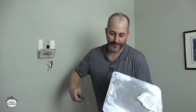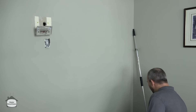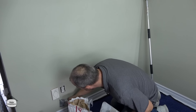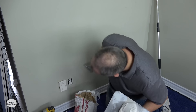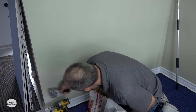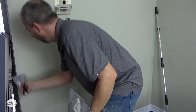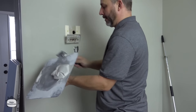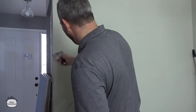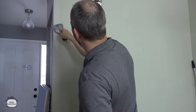No sanding. Clean off your knife on the other side if you have any paint chips — you don't want to drag dirt through your mud. Double-check your wall surface for any other imperfections. Just the process of living in a house and moving furniture can cause damage. Maybe your corners aren't perfect — you can just run it right down the whole corner to straighten it out. Looks like somebody had a wallpaper protector on this corner — I can't do a nice paint edge without a nice wall to work with, so I'm fixing the corner first.